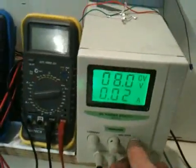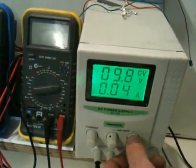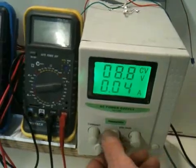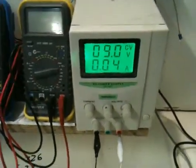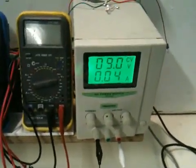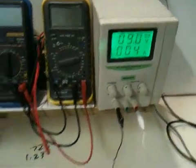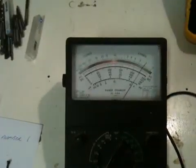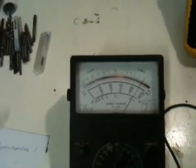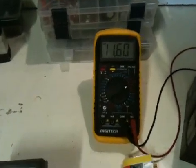I'm going to lift this up 1 volt on the input to 9 volts. Now it's lifted it up to 40mA. So 9 volts at 40mA is now going in. And we now have 45mA, 11.6 volts going into the battery.